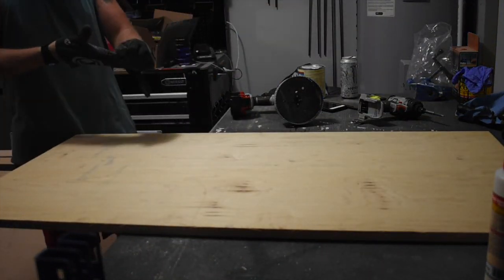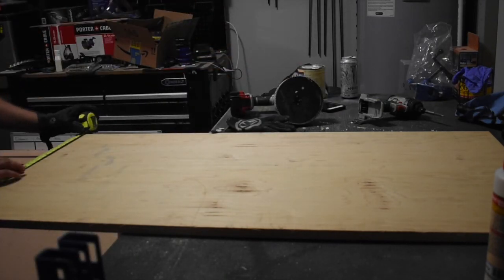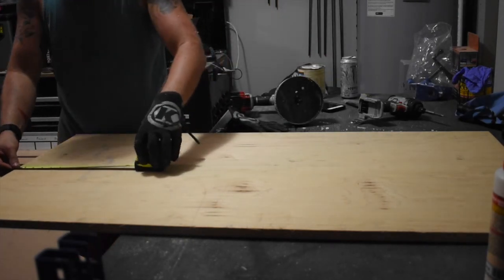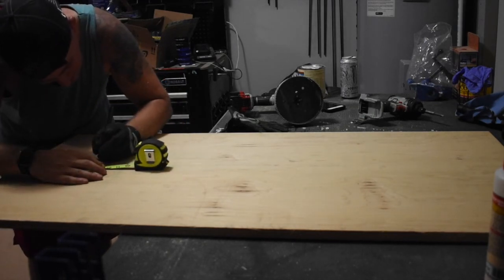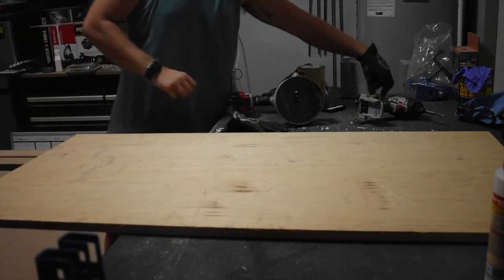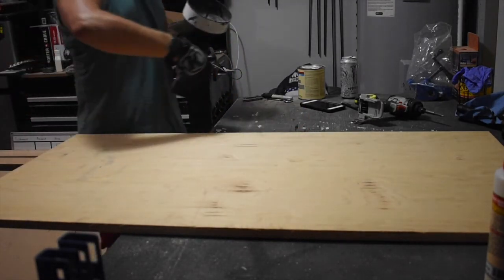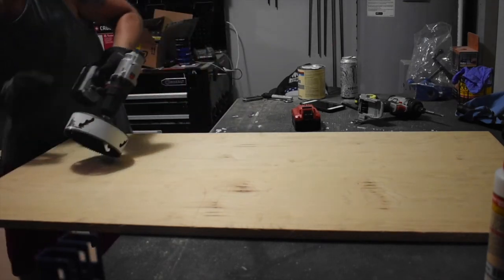As you see, I have a 6-inch hole saw, and here you can actually see me doing the measurements. So I'm going to go over my 12 inches, make a spot, and then I'm going to take my tape measure out again. I'm going to measure down at 9 inches, and then I'm going to move my tape measure a little bit over and make another little incision. That way I know that X marks the spot. That's where I can put my hole saw. Then I line it up exactly where I want it to be, and it's going to cut me out a perfectly 6-inch diameter hole for my cornhole boards.